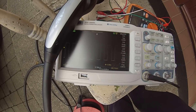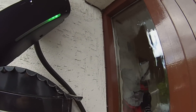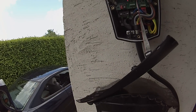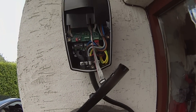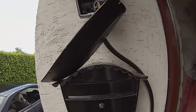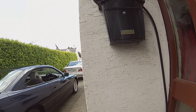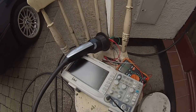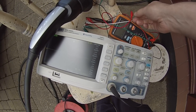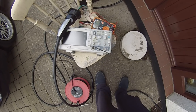At this point, if we now connect our state C resistance, you hear a thump and our power comes on. So it looks as if this unit — if it is in digital comms mode and doesn't receive digital comms — will actually fall back and use the normal J1772 system. There you go. We can disconnect, we shut down, and we're ready to go back through the procedure again.